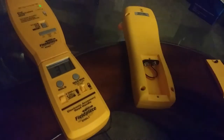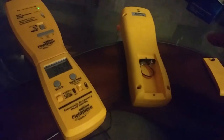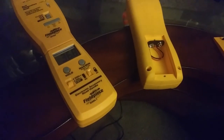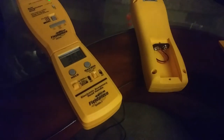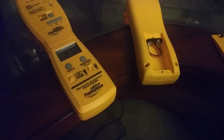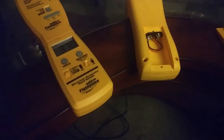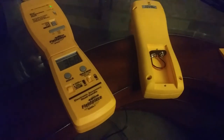On these nine-volt batteries: if it's something I don't use all the time, I'll put the battery in upside down — not with the leads connected. I've never actually seen a nine-volt battery leak even when completely discharged, but apparently they can. It seems to me that they really only start to leak when they're under a load, and even when off there might be some microscopic parasitic load. Either way, it seems like batteries leak when they're actually plugged in, so I flip them as a precaution.